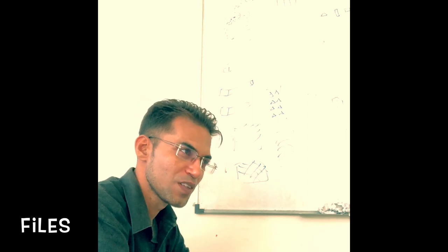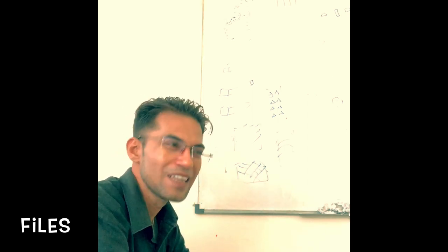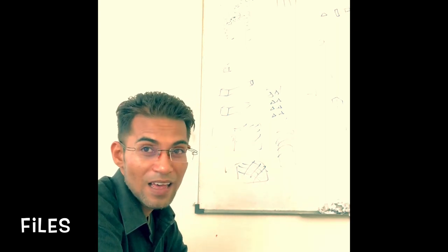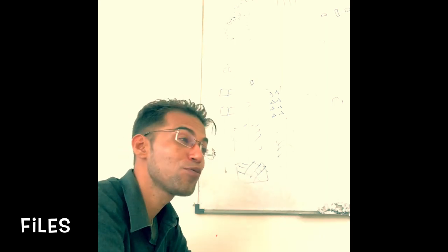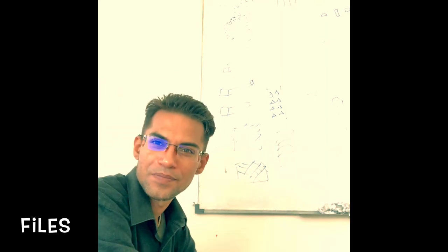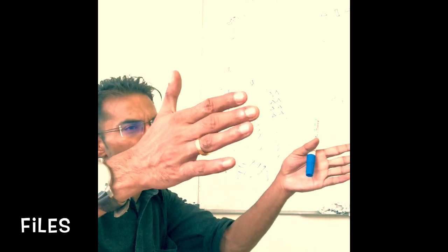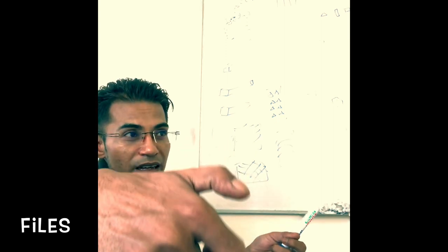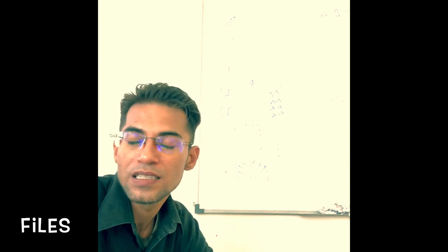So you need to know the proper filing technique, you need to have patience, perseverance, and the correct approach to work, honesty. So the first thing you need to do is, before you start filing, ensure that the work is being properly held. If I need to file one metal piece, the first thing I need to ensure is the work, the metal piece, is being held securely. Right? Probably in the bench vise. So ensure that the work is being held properly.